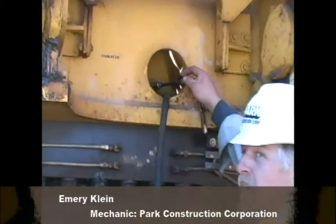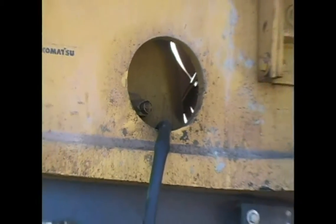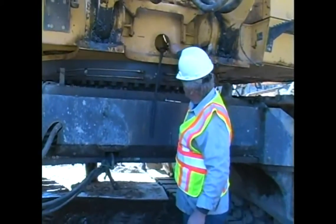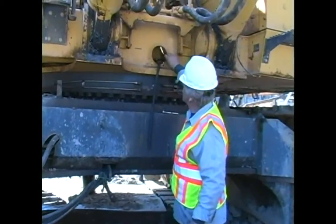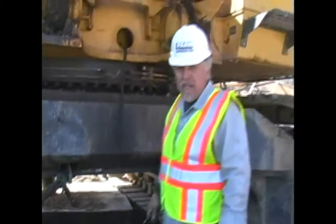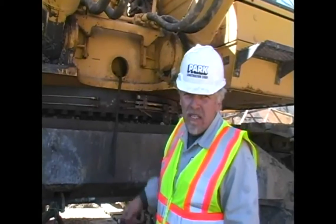This hose normally stays folded up inside the frame of the machine. Pull it out — there's a plug inside. Break it loose and screw it out. My best suggestion when draining these swing drives: break them loose and then move on to another part of the machine. Fluid runs slow through the small hose — sometimes it can take 20 to 25 minutes to drain. You can always come back to fill and close the plug later, because it does take an extreme amount of time to drain.